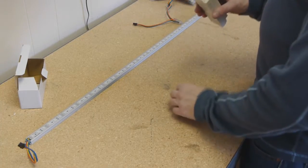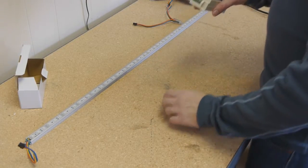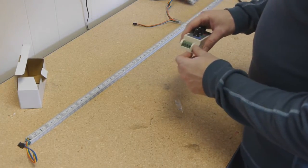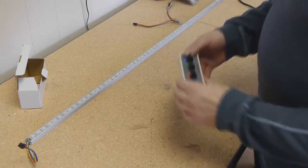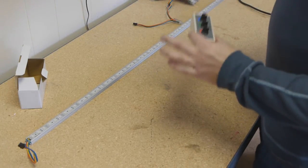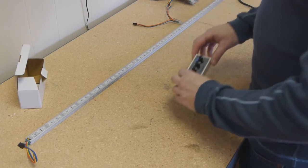On the other side is the output side, again a removable cover, and there is a common connection, a red, green, and blue screw terminal on here as well. Now these are used to operate common anode RGB devices, meaning that it switches or controls the negative side. So there's a common positive connection on this. That's important to know for your RGB nodes.